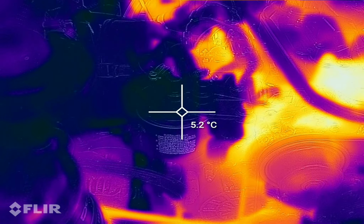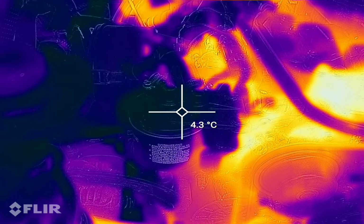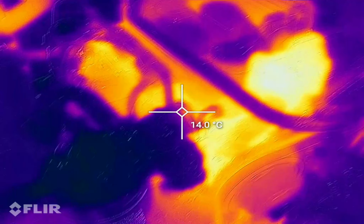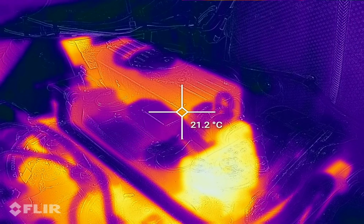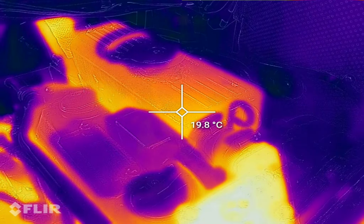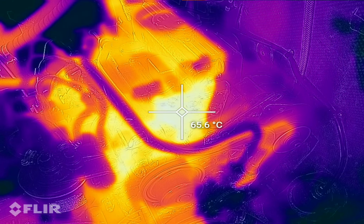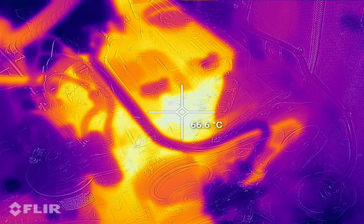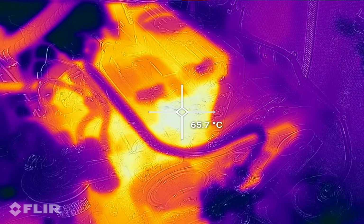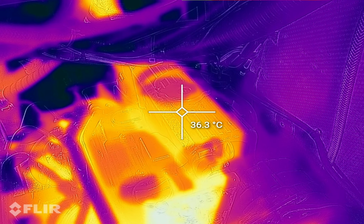And that's the fuel filter, the engine fuel filter comes with the heater. The fuel going in is just below 5 degrees, so it's quite cold. Heat exchanger there, not warming up nicely. Okay, been running for about 10 minutes now, so that's 60. We're sort of peaking past 65, so that's good. I think we may be in a good position to put this back at tick over.